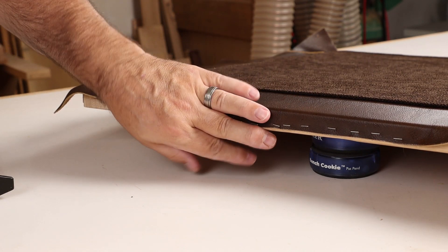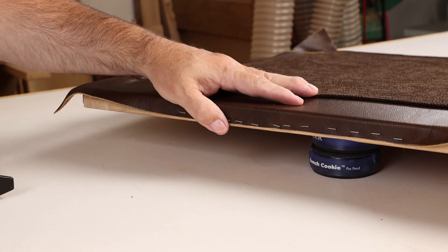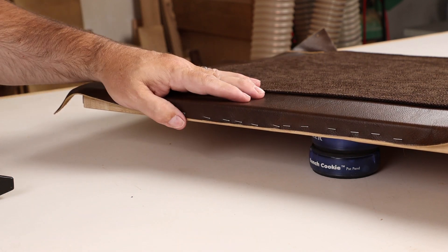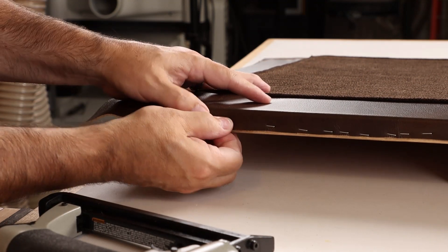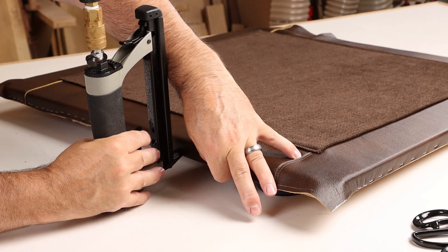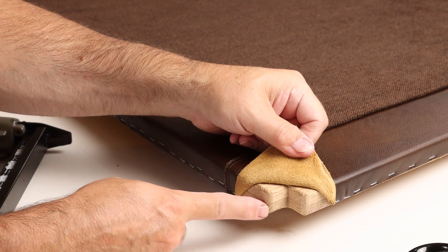You'll notice we're not drawing this to the underside — it's just attached on the edge — and that's because there's a wooden cleat that this frame sits on in the large armchair we're building. That just gives a nice bearing surface for the wood to lay right on the cleat with no upholstery in the way. Just keep working it towards the corner, drawing the slack out as you go. This is a lot like doing a basic dining room slip seat. We'll have a look where our inside corner is and you can continue stapling out to the first corner.